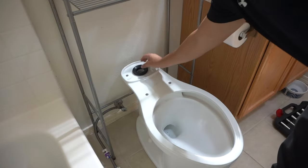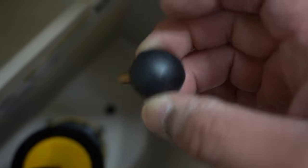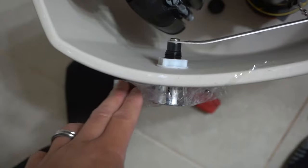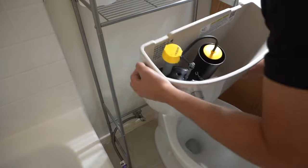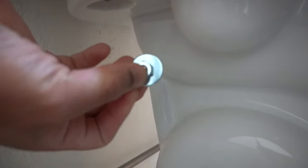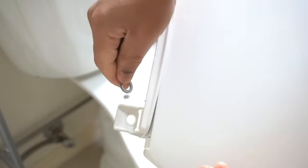Now this is the flange that connects between your toilet bowl and your toilet tank. The newer tank has very nice toilet tank bolts — the old ones don't have this nice surrounding plastic piece with the rubber surround attached. The new design also has a canister valve, which has a much better mechanism than the old rubber flapper valve. The flappers are the older version; the canister valve is a lot better. Go ahead and attach the toilet tank to the toilet bowl — again, don't over-tighten, just enough so that it is nice and sturdy.